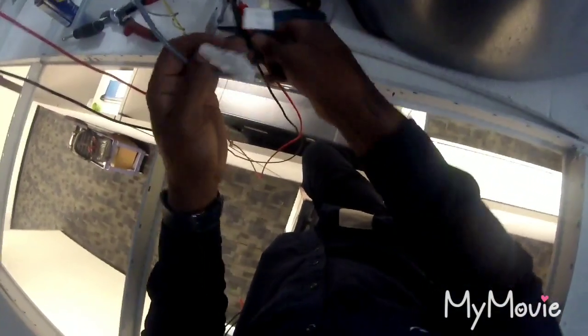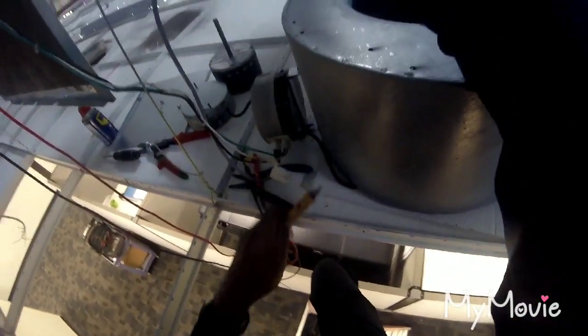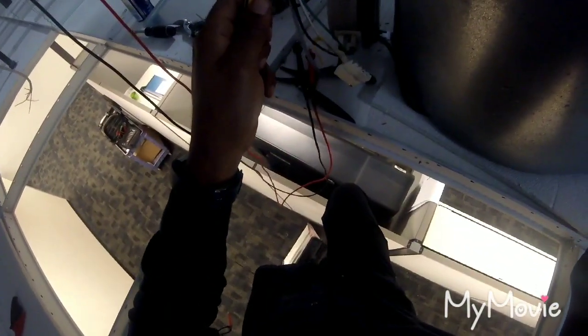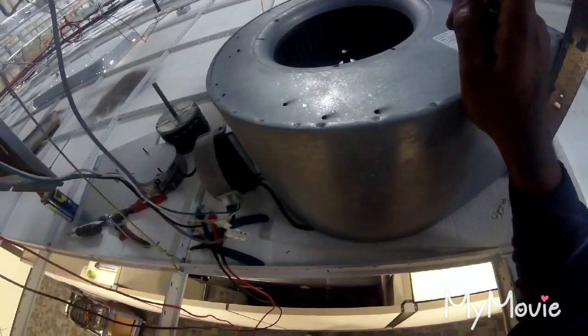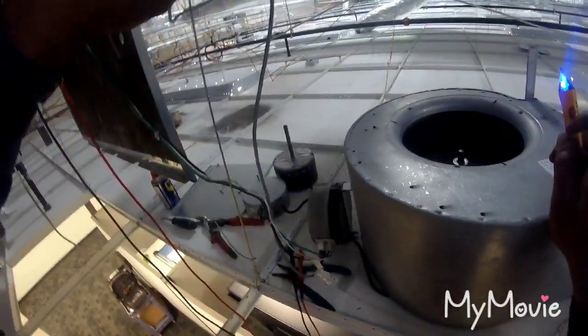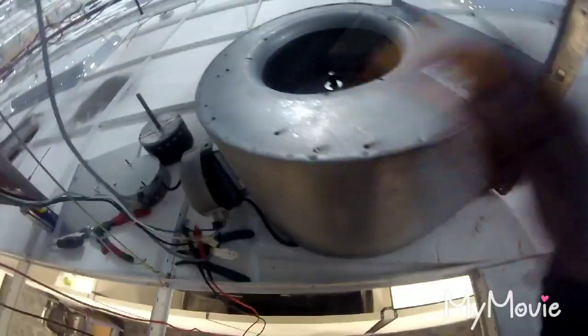Hook up the Tech Inspect to the low voltage. It comes with two harnesses. Pick the harness that'll fit. It snaps in. Got it in the off position. When I get 24 volts, this should turn green. Alright, it turns green. Still got my high voltage at all times at this motor, so this is going to eliminate my control. The Tech Inspect is acting like the controller is giving me my signal to turn the motor on. See, I verified that I have high voltage to it. Power. This is the new motor here.